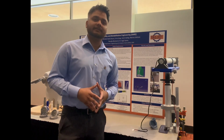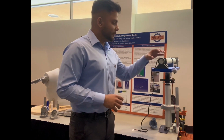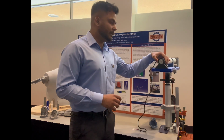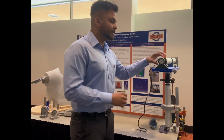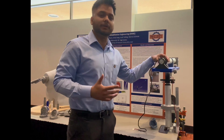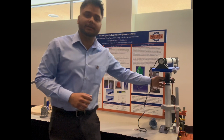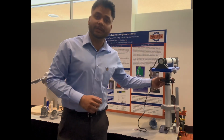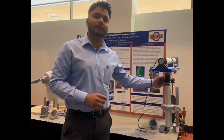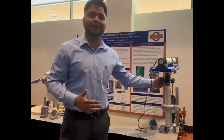Throughout our design process, we learned a lot of things. One thing specifically, we found out that there's a carbon fiber infused 3D printing material that would allow for higher strength. So none of these sub-assemblies crack or break under pressure. A lot of these dynamic rotating parts will also be fatigue free. So with multiple cycles, they're not going to be damaged or get to the point of replacement.